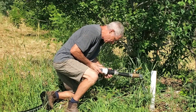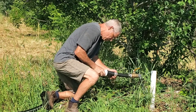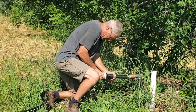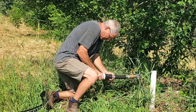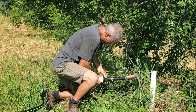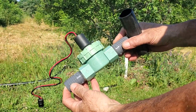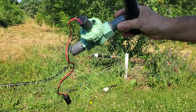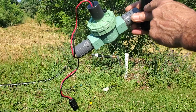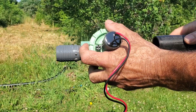Since this irrigation zone is going to be operating wobblers, these wobblers require up to 25 PSI — so 25 PSI water pressure or less. So we're going to be putting in this pressure reducing valve. Anything that goes in, no matter what the pressure is, only 25 PSI comes out the other end. On the valve, you'll see there are directional arrows — this is the only way the valve is going to work. If you put the water flow the opposite way of the arrow, it will never work.